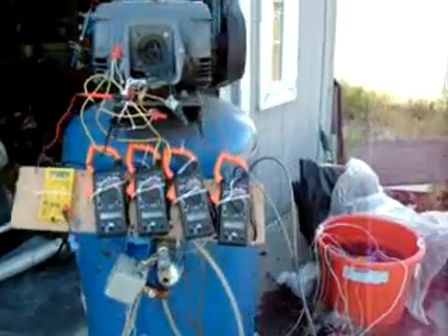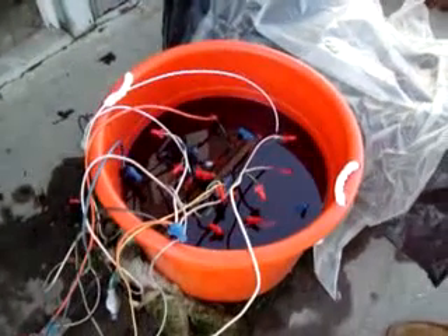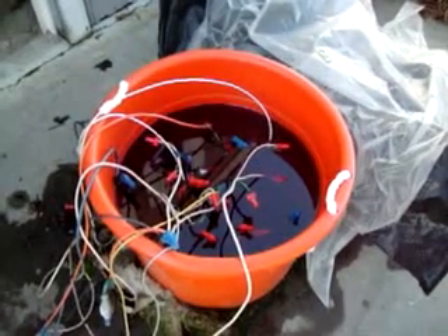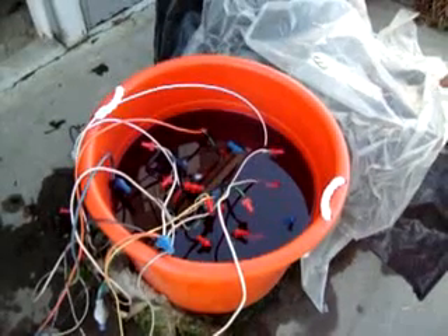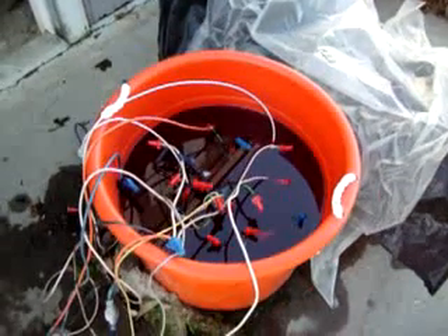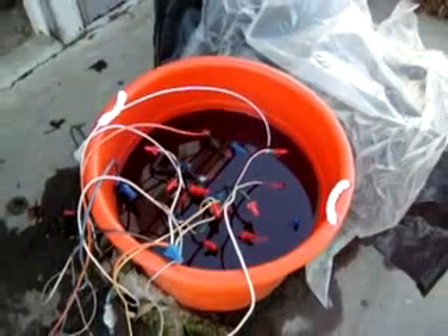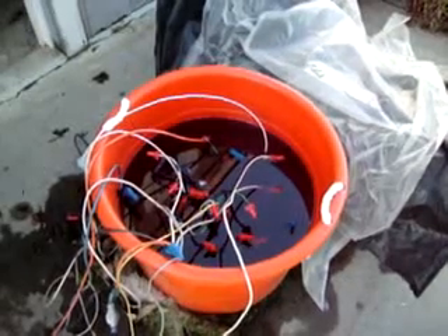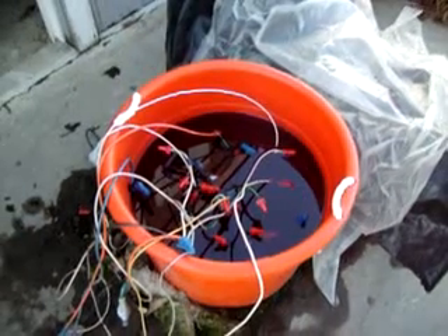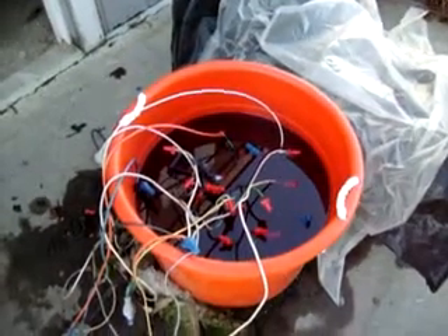We're making this quick video. Over here we have the transformer. This transformer is sitting in a bucket full of oil — it's actually automatic transmission fluid from a car — and we're using the oil to cool it. I did this as an experiment to see if it would work, and it does, it works perfectly. We wound this transformer — there's about 800 feet of 12-gauge copper wire on it, that's equivalent to about 2.5 millimeter in Australia — and that would be about $88 worth of wire at today's prices. The core you wind it on, you go to a motor rewind shop and they strip the copper out of old junk motors they're getting rid of, and you get the cores from them for $5 or $10 — they sell them for the scrap weight of the steel. You can make a deal and get 50 cores, 100 cores, whatever you want to do.